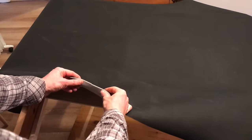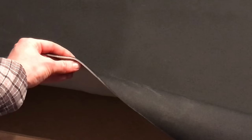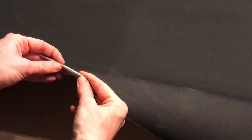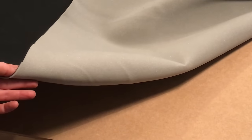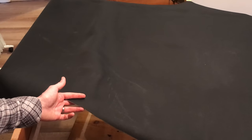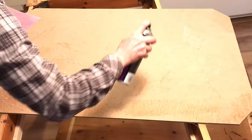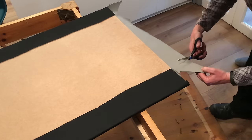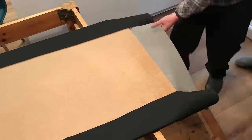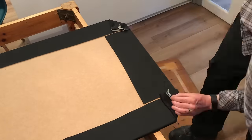The next bit is going to be potentially a little bit tricky. This is like an expanded foam on this side, so if you stretch it too much it's going to put tension and make it feel really thin and potentially a bit cheap. So I'm going to put contact adhesive on the board, lay it over, hopefully do it straight, flip it over, then just tension it a little bit and put some staples in. As it turned out, that Nemesis spray adhesive was better than I could ever imagine — it comes out like Spider-Man webs, really stringy, sets almost immediately on touching, but still gives a little bit of rework. I made a bit of a meal of cutting the corners and folding them in — what I should have done in retrospect is cut across the diagonal and folded it in. But I staple-gunned it and it's just worked out fine.